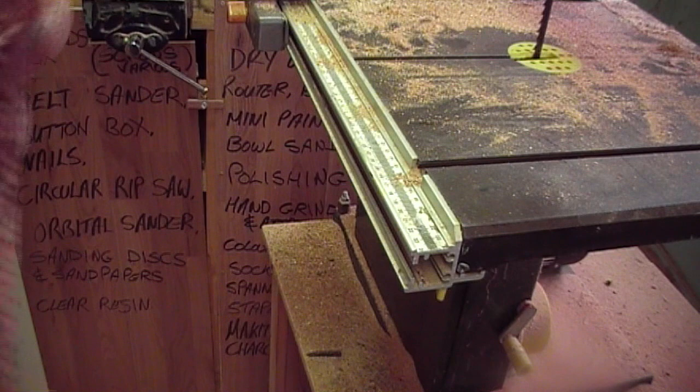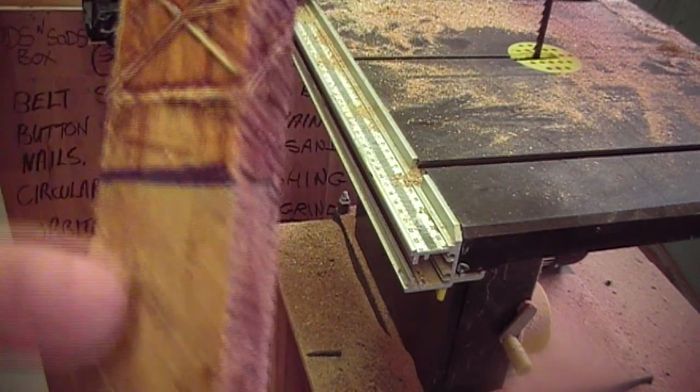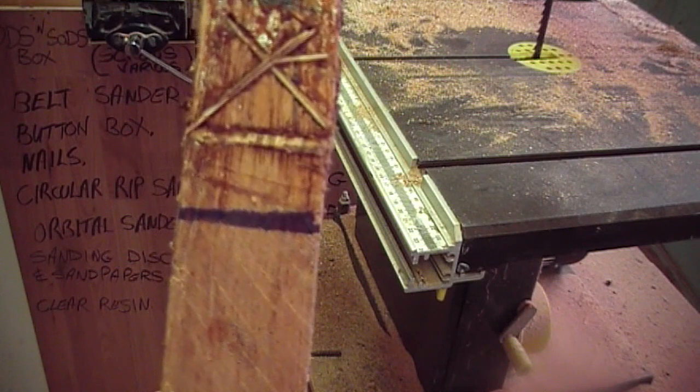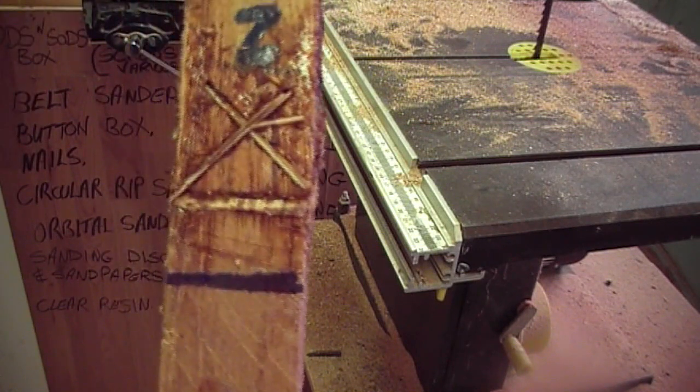So you're going to chop it on the bandsaw now on the blue line. That's where the big brass goes, and then the little brass rose goes in the bottom. So we'll do that, and then we'll set it up on the lathe and drill out for the brass inserts and give her a spin.